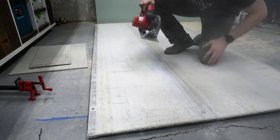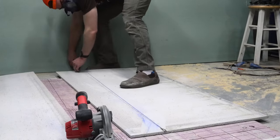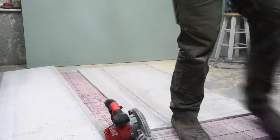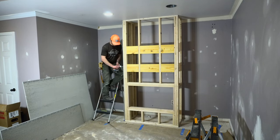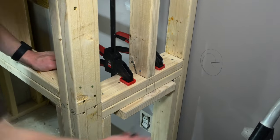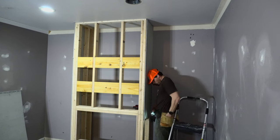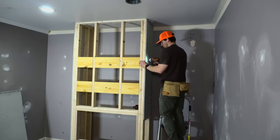First things first is the tile backer — some cement board from Home Depot. You want to use that for any tile work because it's got a nice rough surface so the mortar will really bind. I'm cutting it with a regular old reciprocating saw — it'll ruin my blade, but it's still cheaper than buying a fancy one. Once cut and installed, make sure you're using the proper screws. If you work alone, find ways to work smart; here I grabbed some scraps as a shelf to hold the board, and once the bottom was locked in, I jammed in a shim to get the top lined up.